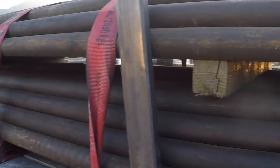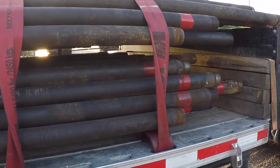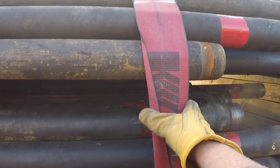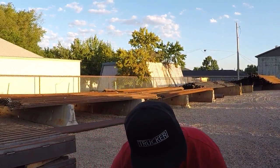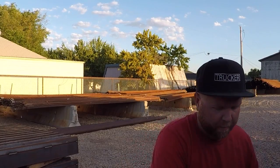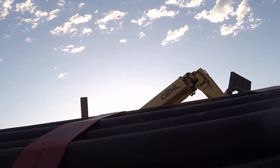They put four stacks of pipe on, then we added three more pieces of dunnage and finished loading it up. Then I put on 10 straps total — these straps are 5,400 pounds a piece. The load is 48,000 pounds, so 10 straps at 5,400 pounds gives 54,000 pounds worth of straps, so we should be more than covered. He wants to unload me now, so I'll let you guys go.